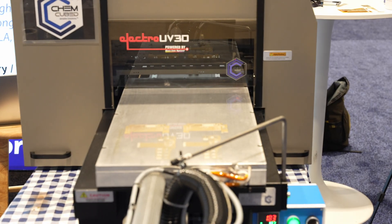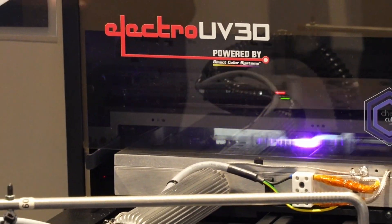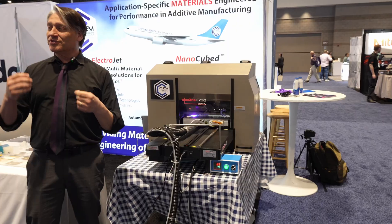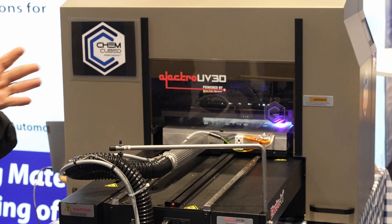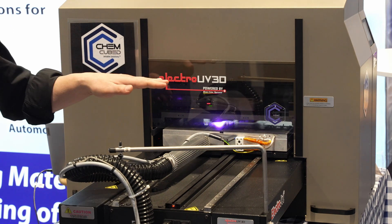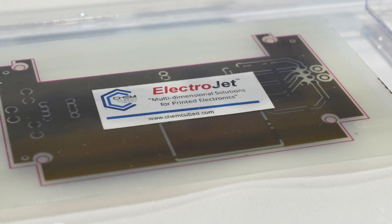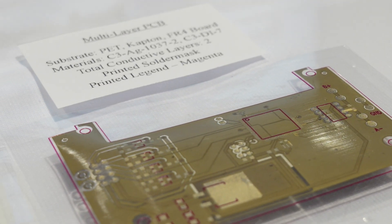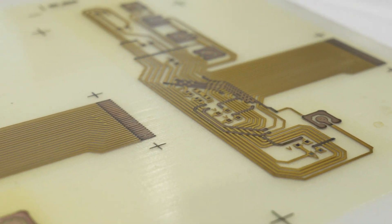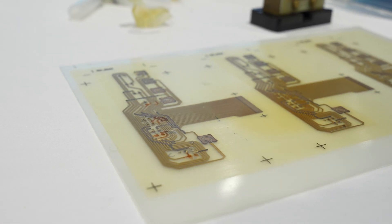In order to sell the inks, we also have a printer. This is our introductory printer here — as you can see, it's printing right now. The printer itself has eight channels, so we can put eight different materials. Not only silver ink but dielectrics. You have silver printed on the substrate, then you can print dielectrics and make a multi-layer, multi-functional board. You can have vias within the dielectric to connect the upper layers to the lower layers, and you can actually print silver right into the vias — so you can plate the vias and have a fully functional board.